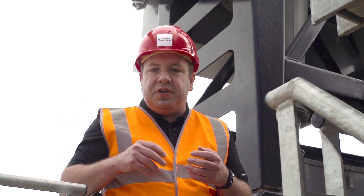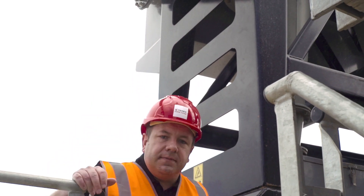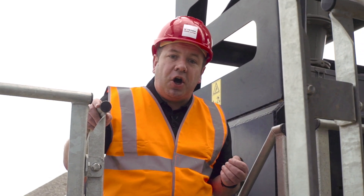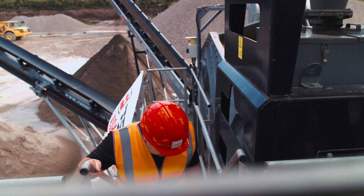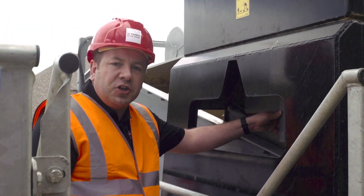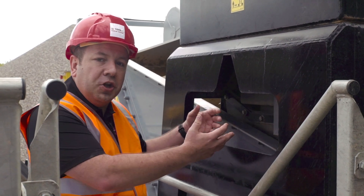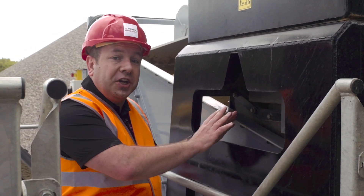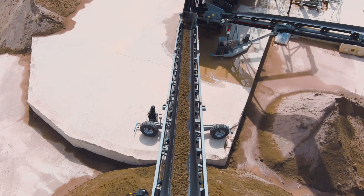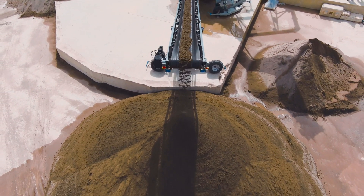This collection box is also our second opportunity to blend the not-to-two millimeter sand into the not-to-five millimeter sand. It's done by this easy slider box underneath — sliding it one way brings all the not-to-two sand to one side, and pushing it the other way blends all the not-to-two into the not-to-five on one side of the screen. That's actually how the customer is running today — he's looking to make as much zero-to-five as possible.